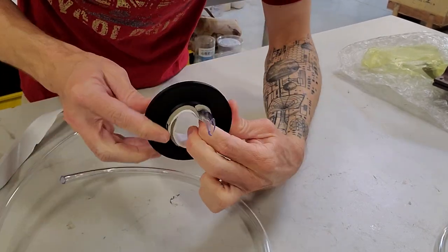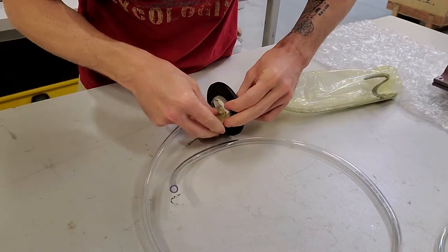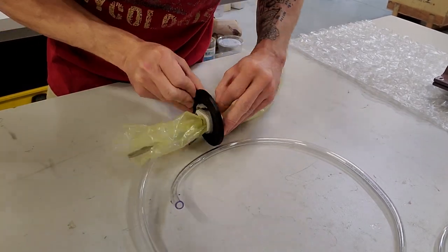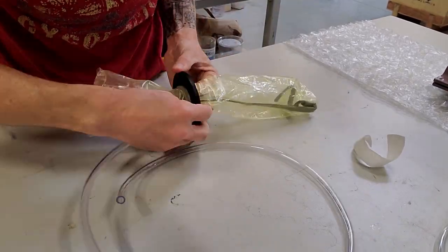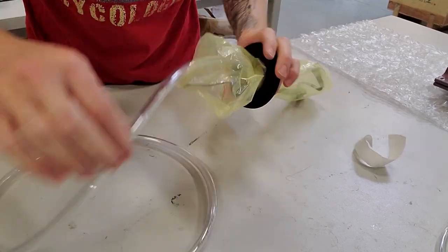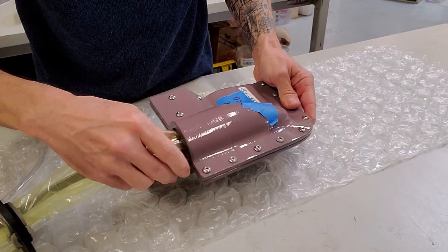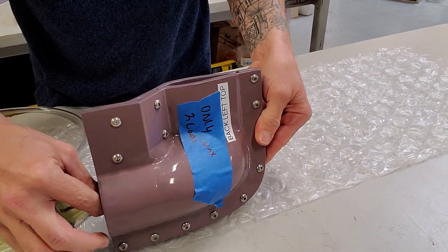I wish I had a larger diameter, and in hindsight, there is a way to redesign this tooling so that it does have a larger diameter, but you know what, maybe on the next project. So now I'm just applying the tape to the bladder to try to get it to seal in place. I'm just kind of randomly mashing it in place here. This is not a good way to do this, as you can get a bunch of little micro creases in the bag, which can all leak, as anybody who has experience with vacuum bagging can relate to.